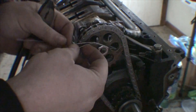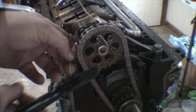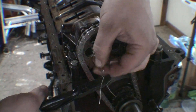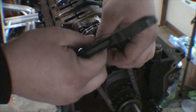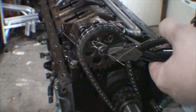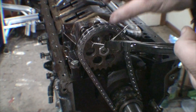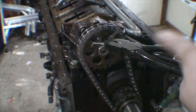In terms of our next move: you can see how the twist ends here. I'm going to take this part of the wire and run it down behind the sprocket in the opening. The reason for that is it's already twisted in that direction, so when we bring the wires through and start twisting on this end, we're not going to have to worry about this twist unraveling. We're going to twist clockwise, so we want to set up the wire so that it'll start twisting clockwise. We do want it slightly tighter on this end because we're going to be cutting the wire here and we want the strength of the wire to basically hold it twisted together.